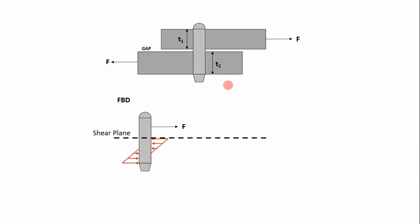As a mechanical engineer, the first thing you want to do is draw a free body diagram. We have a single shear lap joint with a force acting at the mid-span of the top joint and at the mid-span of the bottom joint, with some gap between them and thicknesses T-sub-1 and T-sub-2. Looking at just the bottom joint, we can assume a triangular load — pulling the top joint creates a reacting distributed load on the bottom, pressing left on top and right on the bottom. You can visualize the dowel pin being cockeyed, and that's the type of distribution you can assume.